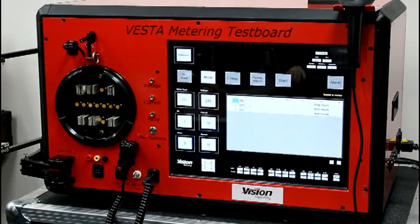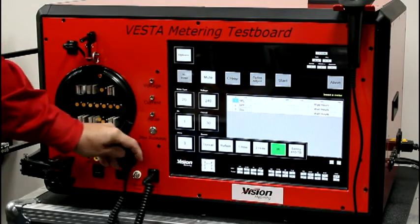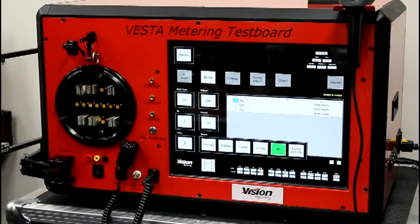We also have the capability to select which port or which optics we want to use. We can use the Opticom port right here, or we can use a reflect, 1 hole, 2 holes, or IR, which we would use in the case of Itron Centrons and Sensus FlexNets. Also we have the Century 410, which again is this probe.